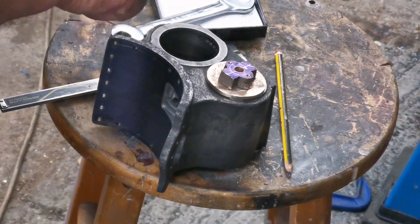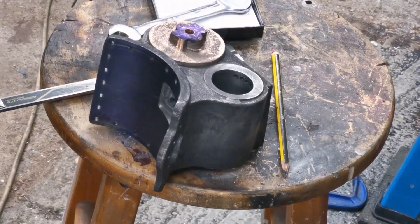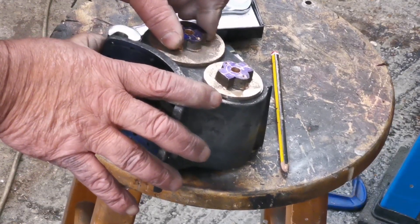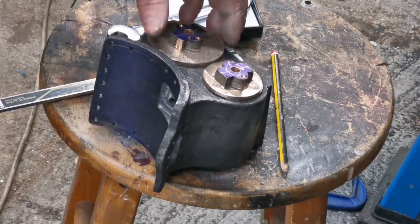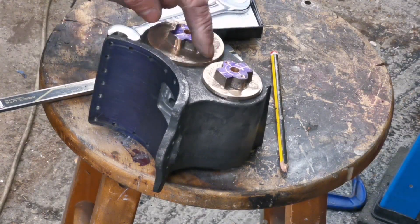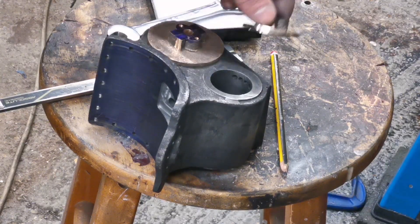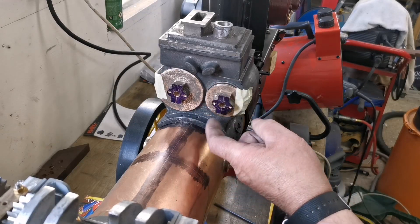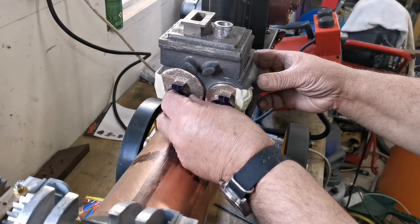As you can see, I've machined the middle part off on the milling machine on both of those. They fit in the cylinders perfectly — there's no side wobble on either of them. The next thing to do is drill the holes to bolt them on. Both end plates are machined to actual size and fit nicely in the cylinders with no side wobble.